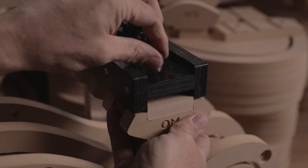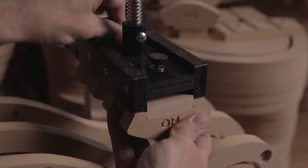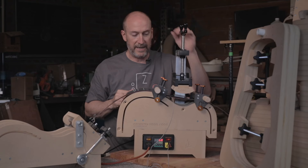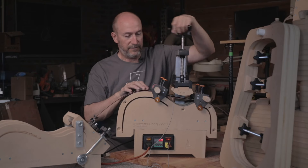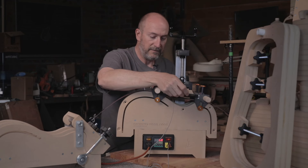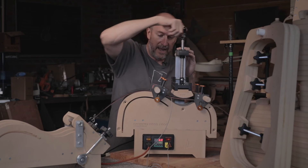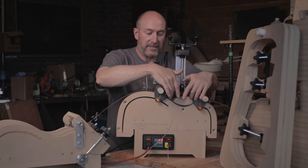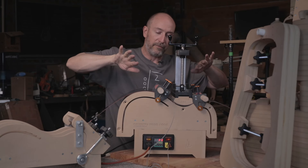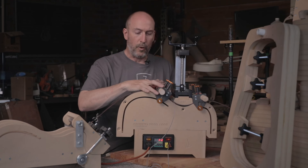There are two thumb screws that tighten up and make sure that the shoulders of the waist form are pushing into the sliding gantry. Once you have that, it's fairly straightforward. I also have a waist bending slat in here — this is a piece of 0.020 blue steel spring steel. It presses down and extends the footprint of the waist forms, making sure that even further out from the waist forms you're getting good pressure along the guitar form.